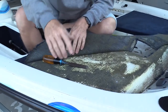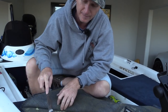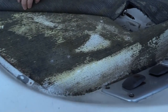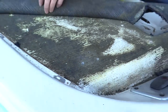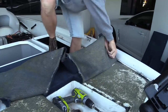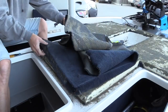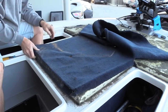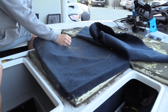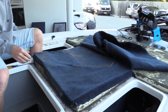We scrape the original stuff off firstly with a chisel — I find it's a lot easier than a paint scraper — then I'll use petrol to dissolve the rest and get it all back to a highly polished state. Look at the dirt in the carpet — it's disgusting. It's just sand that comes out of the carpet when you pull it up. We vacuum this boat all the time, but that's the sand and grit that gets caught in carpet. No way around it.